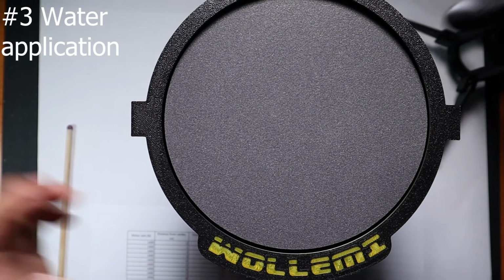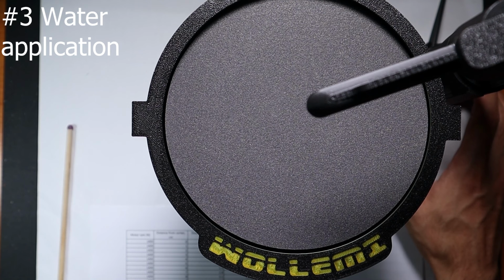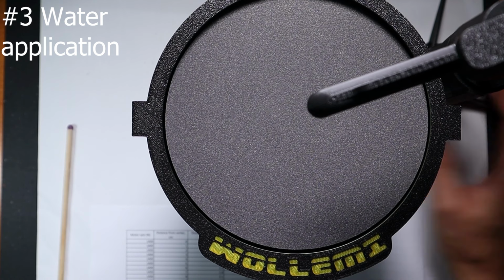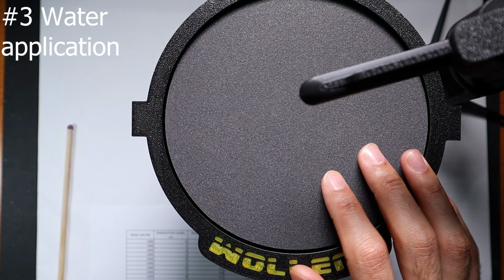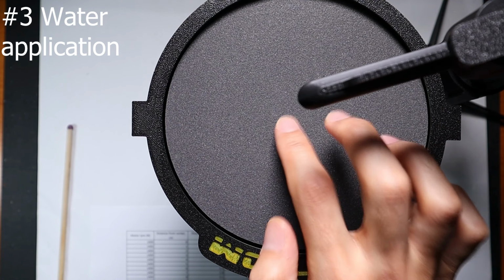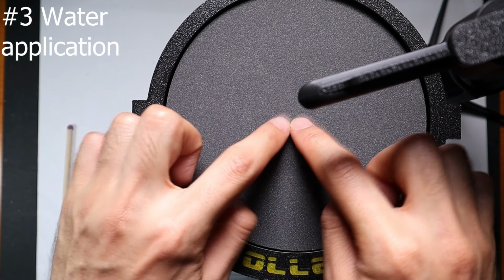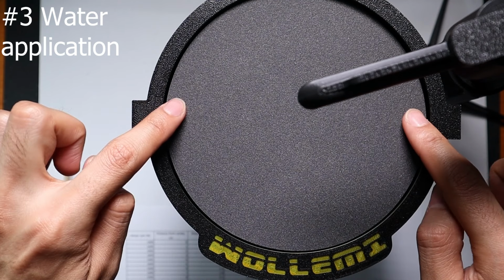Number 3 comes down to how you get water to your stone. Now with carving, a lot of the time I dunk, but I do have a little drip feed as well that I can do. And there I'm just dripping it straight onto the burr. With the cabbing wheels, you're normally spraying the water from the top, or some machines actually spray it in from the bottom, but I prefer it when it comes in from the top. When it comes to a flat lap, just aim for your water to drop towards the center, because the other thing with a rotating disc like this, if something's sitting in the center of it, like a puddle of water, it's going to want to go outwards.